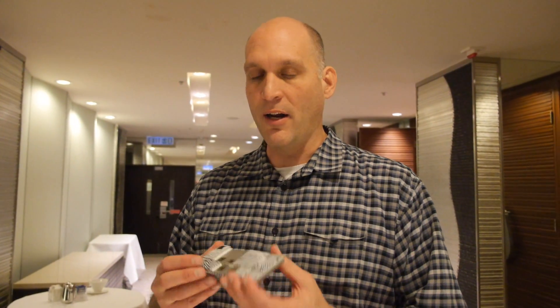Think about it as USB — USB is a very modular bus that anybody can make to do anything based on the specifications. This is just another one. So is Greybus working or how much more work is needed? It's working. This thing boots and works. There's a bunch more protocols we're implementing, like getting the cameras to work with proper protocols, and a whole bunch of polishing with real hardware. The code is all open. You can check it out and run it right now. You can simulate it on a BeagleBone, or we have simulations so you can run it on your laptop. We do a lot of development that way.